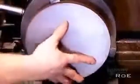The plates go one at a time onto a lathe. First, the machining tool smooths and evens out the surfaces, getting rid of the marks the saw made. Then it cuts out a small hole in the center of one plate and a larger hole in the center of the other.